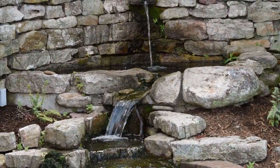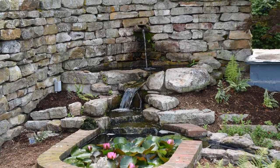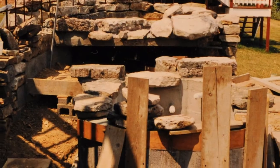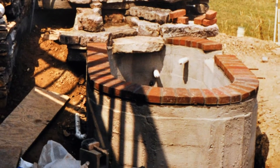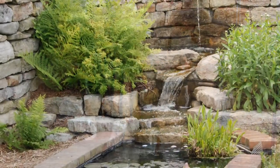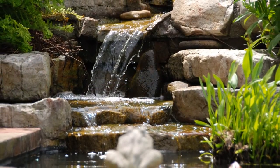As a sidebar, the Ivany block construction was used in the middle pond, shown here, and in the lower pond also. To date, its reinforced concrete has lasted over 15 years. The block forms the structure for the concrete fill. The wood form spans significant bends at the ends of the pond. With the wood forms removed, the gaps spanned by the wood are clearly shown. The inside of the pond was coated using an epoxy pool paint, and the exterior was sealed with a cement-based waterproof product.